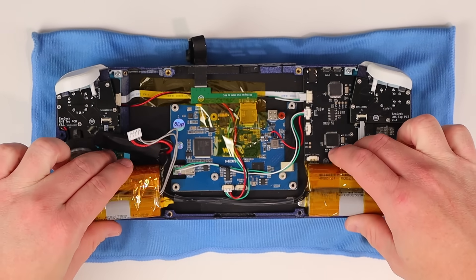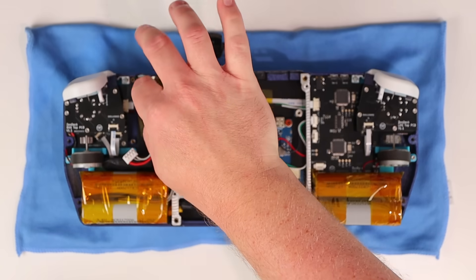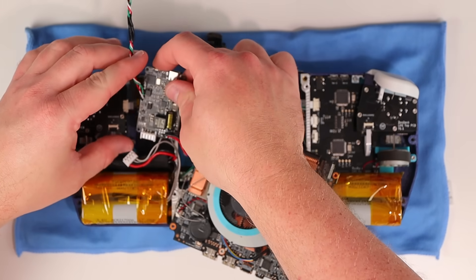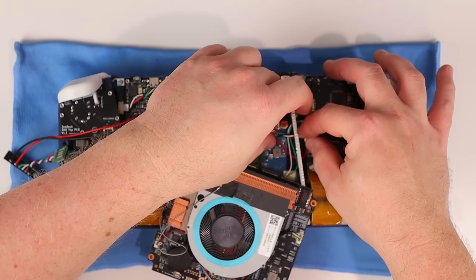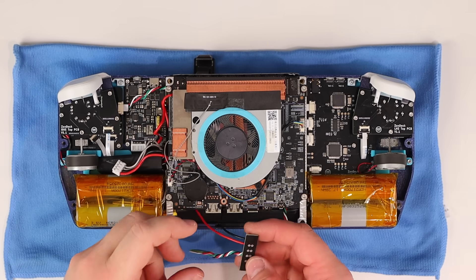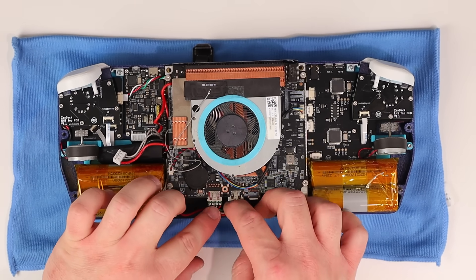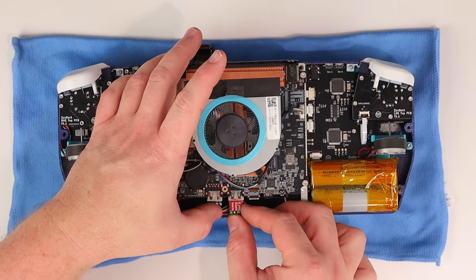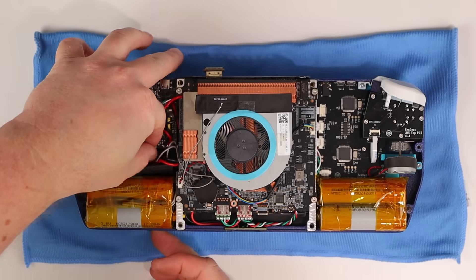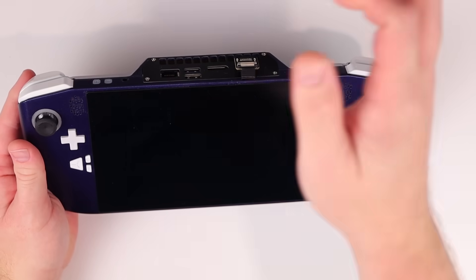Next, the battery pack can be installed, followed by the display mounting bars which also provide a mounting spot for the PC. I had 3D printed these originally, but they were bending in the prototype, so for the final build I've CNC'd some out of aluminium. Now for the tricky bit — the PC and power management. This little power management board is another thing I've had to design; it goes between the battery and the computer and basically functions as a UPS, handling all battery-related tasks and reporting capacity back to the computer so it can be displayed like any other laptop. I've already soldered wires behind the power jack on the mini PC and connected them to the output of the power management system. All that's left is to connect the power wires from the docking connector to the secondary charger input, connect USB wires to a spare USB port, connect the other USB port to the controller, hook up the HDMI adapter, and finally plug in the battery. The back cover is held on with eight screws in the back and the final two through the outlet plate, and that's it.